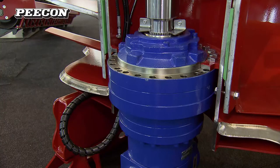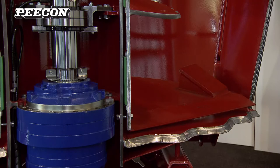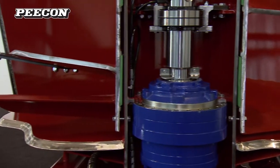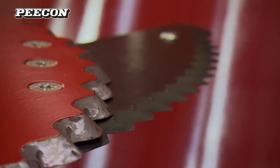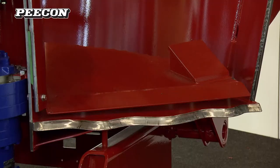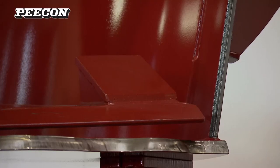The auger is made of steel with a high tensile strength and equipped with an ejector to create an equal discharge pattern, one extra ejector to give a continuous feed discharge, tungsten carbide knives mounted with countersunk bolts, and a beveled steel bottom knife out of highly strengthened steel.